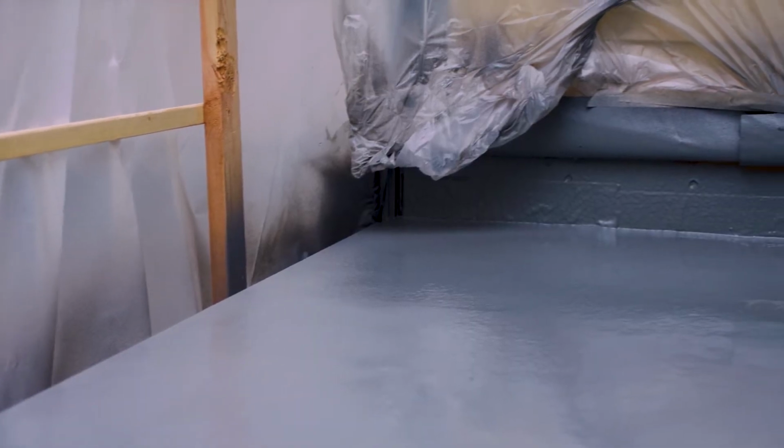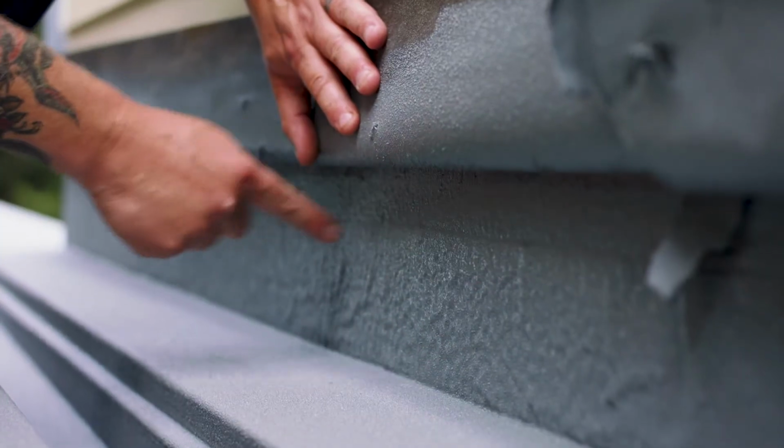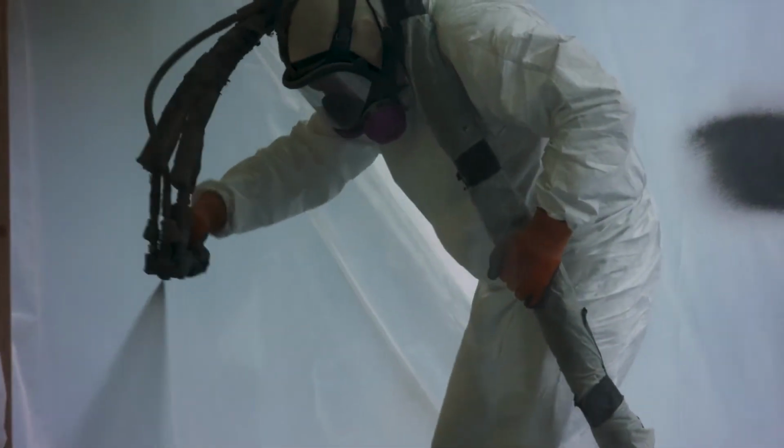The main benefits of the product, Polyurea, are it really moves well with the substrate. I talk about coefficient of elongation. How far does it move without failure? Plus minus 450%. So you're not gonna have breaks at seams. It's 100% solids, zero VOCs, no volatile organic compounds.